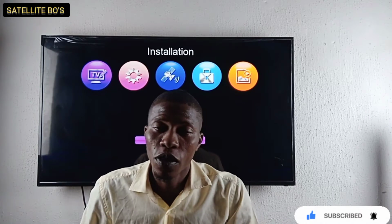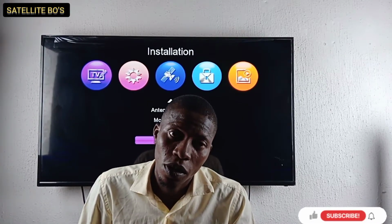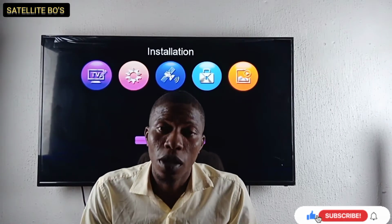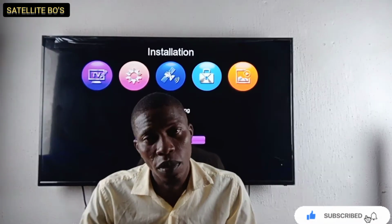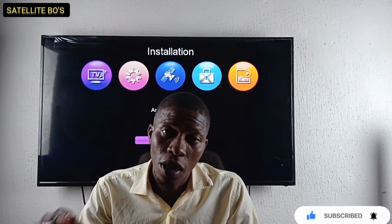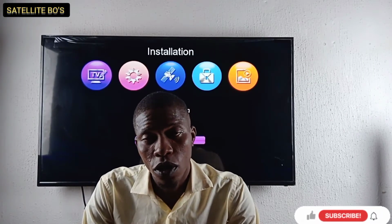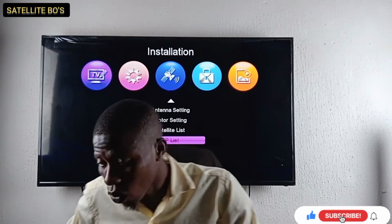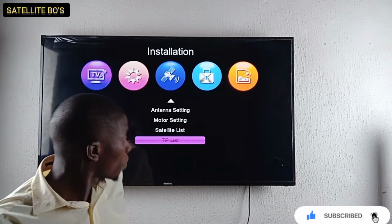So for example, for this video, we'll be tracking Astra 2A. Astra 2A normally it's on 28 degrees east, and it has its frequencies, and one of the frequencies is 12525 polarization V and symbol rate 30000. So let's just go to our device or decoder.